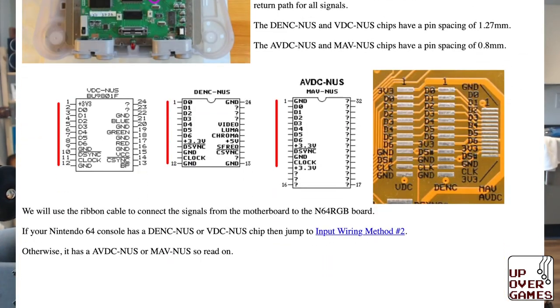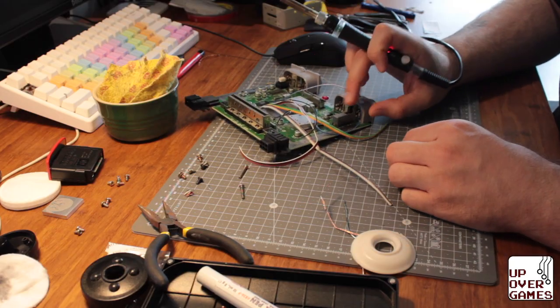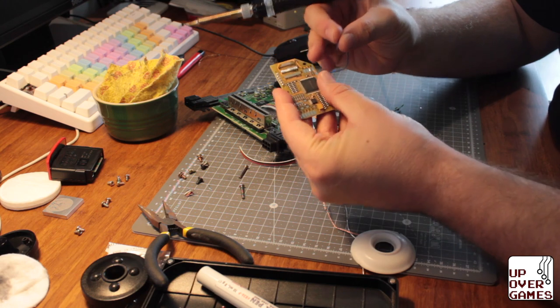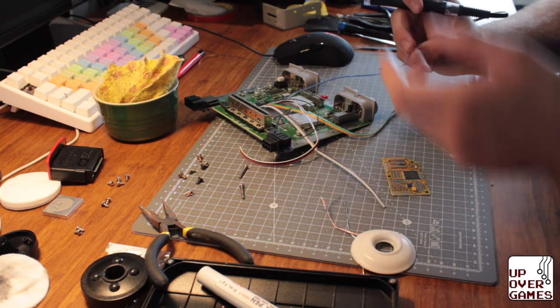So yeah, I just used a drag technique to sort of cover the pads on here. And now if we look at etim's setup, he's saying that the 12 pin, which is the blue cable on mine, that's the ground. So if we have a look on here, it would just be like the bottom, and I'd work my way up. Can't really see it, but yeah, I would work my way up through here. So I'll get started on doing that.